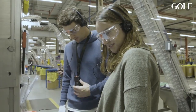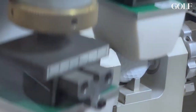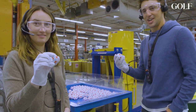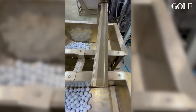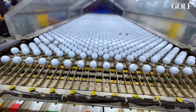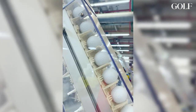And now, what makes a golf ball really look like a golf ball? Norm walks us through the ink and the painting. This is the actual process where we decorate the product — white balls go in, decorated balls come out. At a high level, this is a pad printing process. There's ink on a plate, and the pad picks up the ink and deposits it on the ball. We have a base coat and a top coat. The balls are fed in behind a stainless steel enclosure, rotated at a specific speed, and sprayed with paint. We control that speed and the spray to make sure the balls get an even coating. Then they transition over to robotic picker arms and move down the conveyor where the paint is cured.